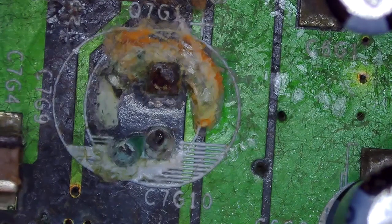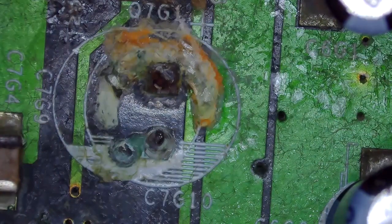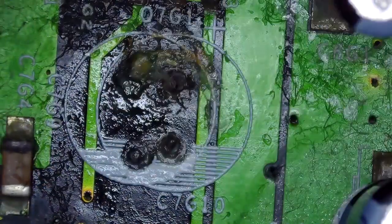I'm going to show you what it looks like on top of the motherboard right here. You can see that it doesn't look too good, but it doesn't look like it's spread too much, so I think we should be fairly good. I'm going to use some rubbing alcohol and some q-tips here to help clean this up. Some people recommend white vinegar but I'm not 100% sure what's the best thing to do — rubbing alcohol seems to do the best job for me. I use a q-tip to clean up a lot of that gunk, and then a toothbrush to go around the whole area of the board.